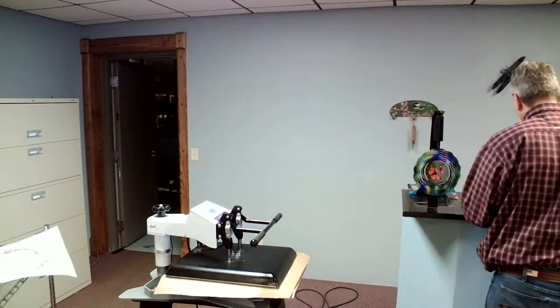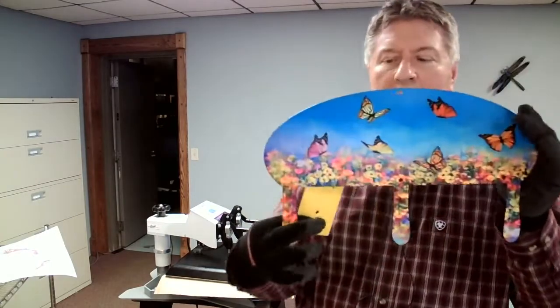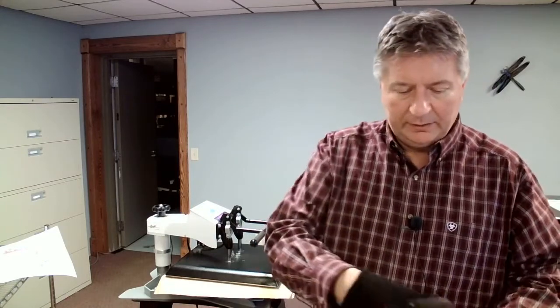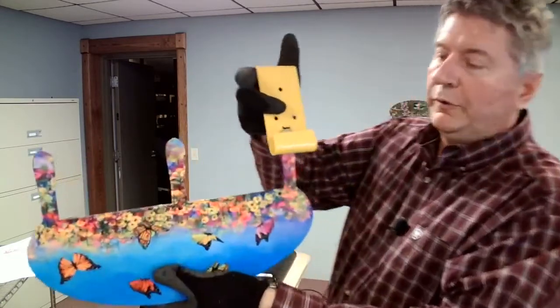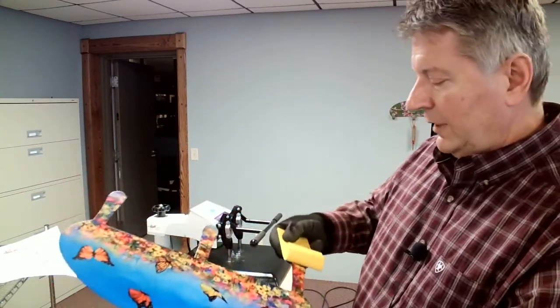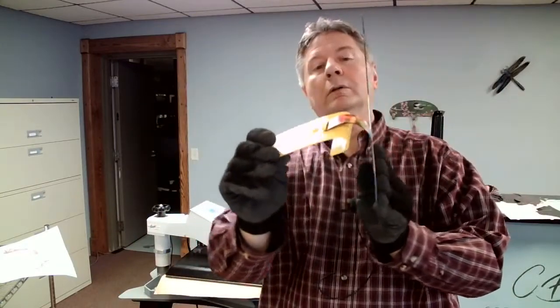All right, so we are going to show you how to bend this one. Basically it comes with a bender, comes with the kit. And these we bend one at a time. We actually have some smaller ones that we bend all 6 of them at once. We just put the hook in there as far as you can so it comes to that stop. And then you're just literally going to roll.